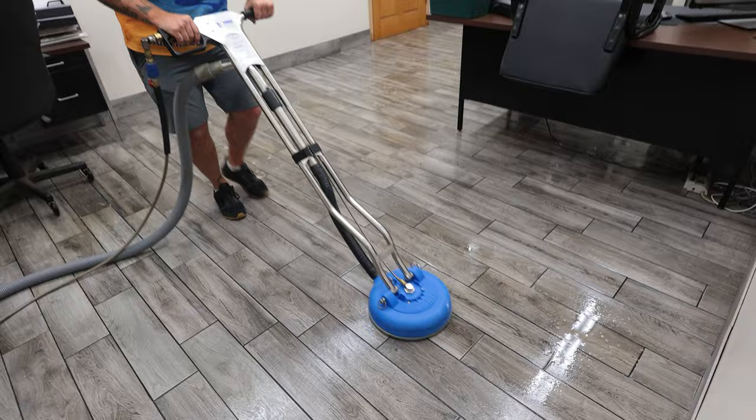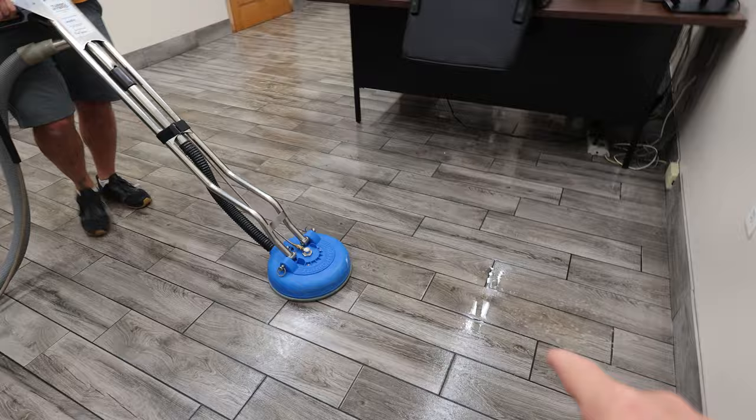So the one thing people need to know, when you're using high pH cleaners, you have to rinse really well. I get calls all the time using other competitors' products where there's a residue left behind, and of course they apply our super sealer and think that's the problem. Super sealer has no cleaning ability. It's an invisible barrier. So if you didn't rinse thoroughly, you will be leaving residue back there. Our Tsunami is designed not to leave a residue.